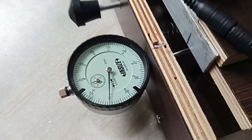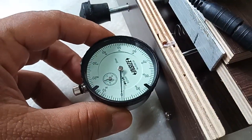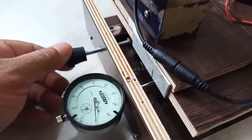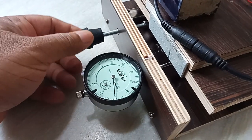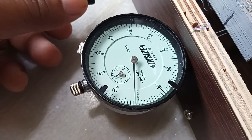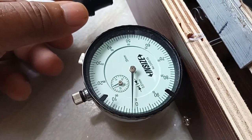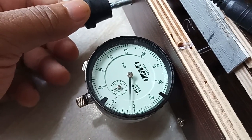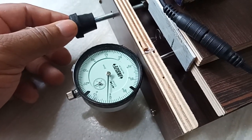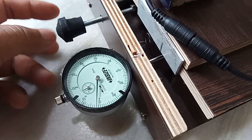The major component I have attached is this dial gauge. This dial gauge gives readings in millimeters and is very precise. Whenever I move and take the knife edge reading, this dial gauge will give me a reading in 0.01mm. It has a 25mm range and a minimum reading of 0.01mm. For precision purposes, I decided to use this dial gauge.